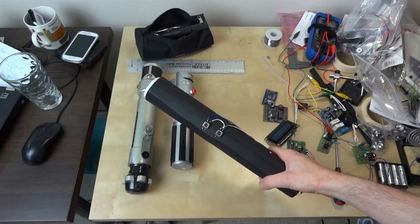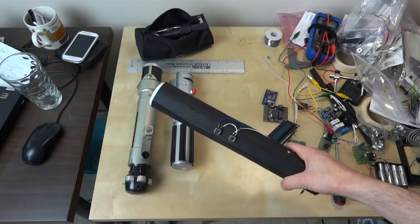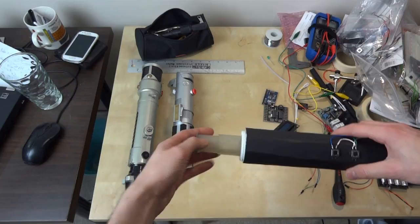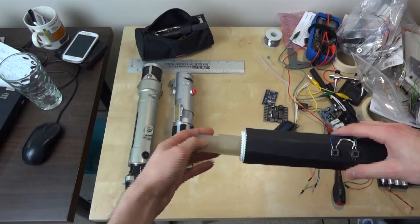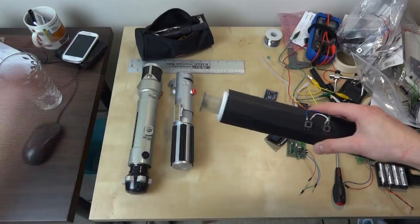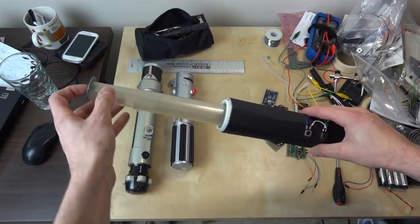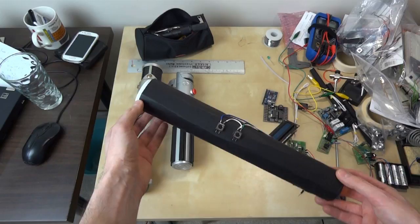Here's my very crude prototype. I have to stress this is a very, very crude mechanical prototype only for the blade. The hilt is made of cardboard basically. The switches and wiring are still on the outside — the buttons to make it go up and down. The blade is actually taken from one of the telescopic Hasbro lightsabers. I had to put a plastic cap on the end so the blade sections cascade in the right order and the smallest one doesn't just fall down the middle when it goes back in.